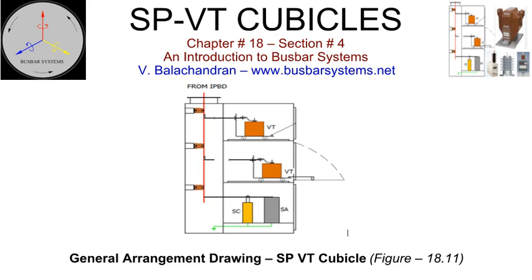While withdrawing, the following sequence of operations for the voltage transformer is ensured. Secondary contacts get disconnected. Primary contact gets disconnected. Secondary and the primary contacts get earthed after safe clearance is established. While plugging in the voltage transformer, the sequence of operation is reversed. The trolley should be positively earthed at all times.